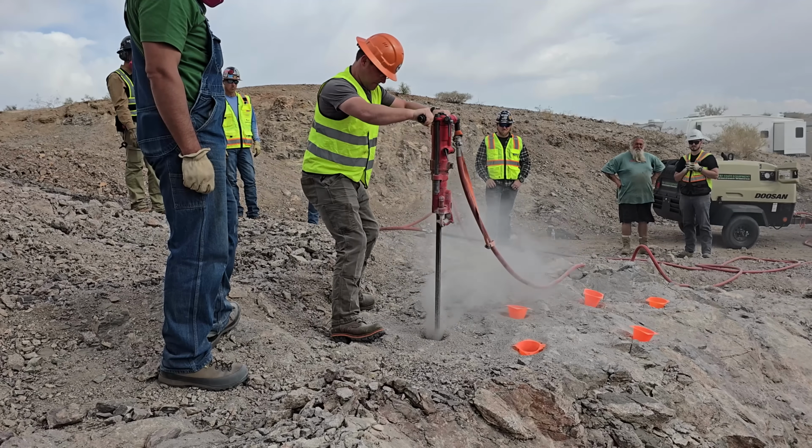Now when we talk about walking the shot, we're going to have eyeballs on all of this. This is only 6 holes, but when you've got 350 or 400 holes, you can see it's more valuable. We just walk up and down the rows and eyeball it. Is that connected? Yep, we can see all these because they're right on the surface where they're supposed to be. They're not buried in the dirt or hanging up here. We can physically see each block that's connected.